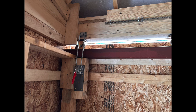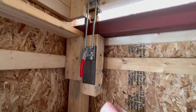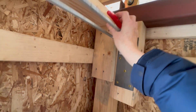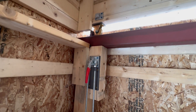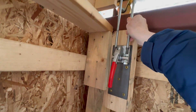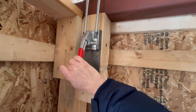Here is one of the installed lockdown clamps. You can see the hook is tied right into the main header of the roof, and the base of the clamp sits on this 4x4, reinforced with a steel plate that goes further down the column. To open it, you lift up the lever and the top swings down — you're fully clear to open the roof. There are four of those clamps and you'd better remember to do all four of them. Putting it back on is as simple as lifting it back up and snapping it down into position.